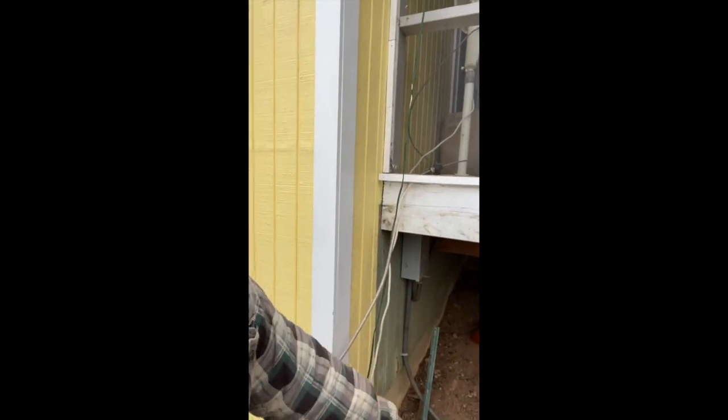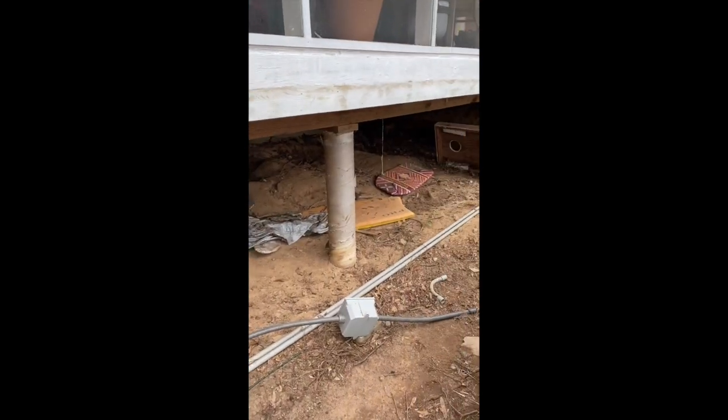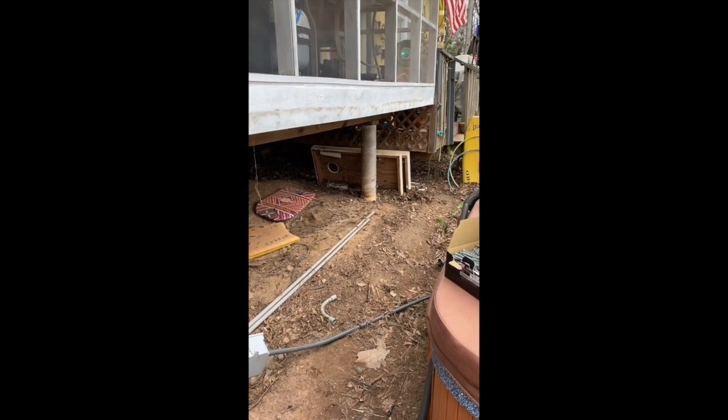So today I'm replacing all of our old nasty lattice that we had on this house with shiplap. So what I'm doing is painting 2x4s. I'm gonna be building a door here, and then I'm just gonna run 2x4s. I'm gonna take this angle and hang it underneath and hang a 2x4 down off of that, and then run the shiplap across the 2x4s like that. This is the old part after the initial demo's been done to get the old stuff out of the way.